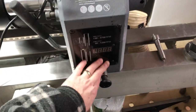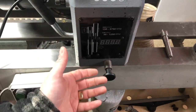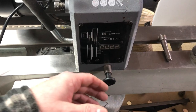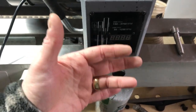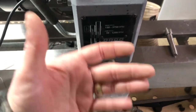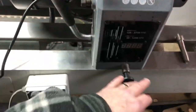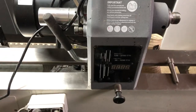On this particular lathe on the front there's a panel which will read out the RPM - the revolutions per minute - so that's the speed at which your lathe is turning. Obviously no use to me, and if you have very poor vision you'll just need to get tuned in to the speed at which you're working and become accustomed to what is the best speed to work with. As a rule I like to turn as fast as is safe to do so - I achieve a much better cut; it's safer and smoother, and you're not forcing anything. The headstock and tailstock can both be moved to accommodate different sizes of work, especially spindle work.